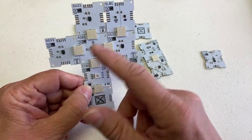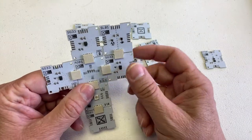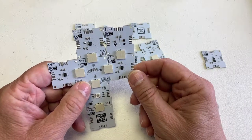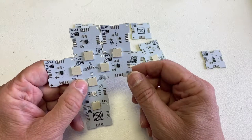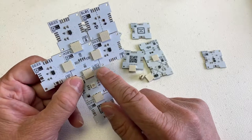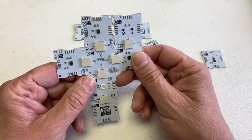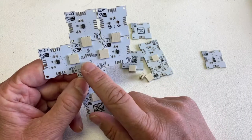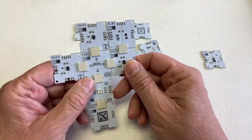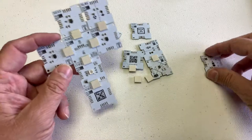The multiplexer is useful, for example, if you want to do something with a lot of servo controllers. Our standard OC05 servo controller can take eight servos, and the servo controller itself can be addressed with a similar setup — so you can connect eight servo controllers without using multiplexers, which means you can control 64 servos just like that. And of course, now you can start putting them into the AI-10 multiplexer and get into thousands of servos, which might be interesting if you do a project with mirrors or something like that.